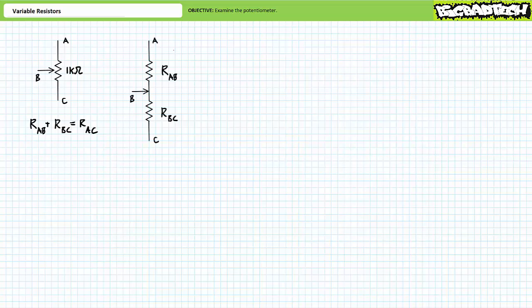If it helps, you can visualize the internal structure as a pair of series resistors, RAB and RBC, where the total resistance from A to C is the full nameplate value of the potentiometer. If you increase RAB by one ohm, you decrease RBC by one ohm and vice versa. Consider a 1-kilohm potentiometer: assuming linear proportional resistance with the B terminal positioned at 50 percent, half of 1 kilohm or 500 ohms appears between terminals A and B, and the remaining 500 ohms appears between terminals B and C.